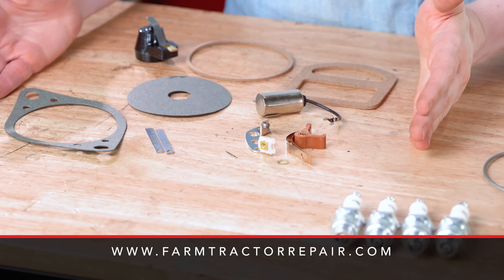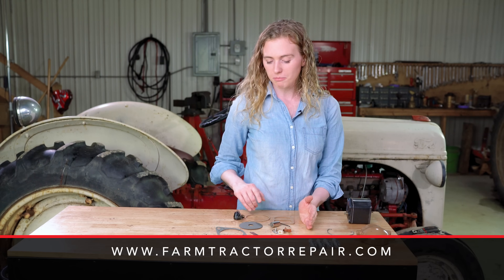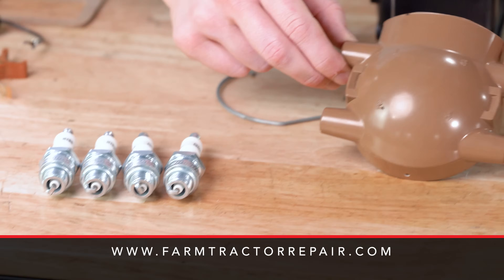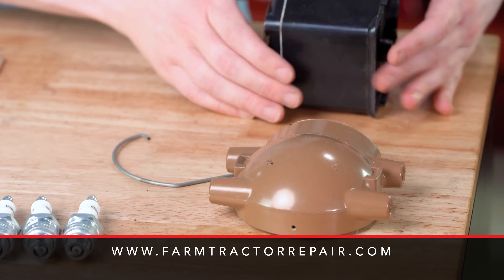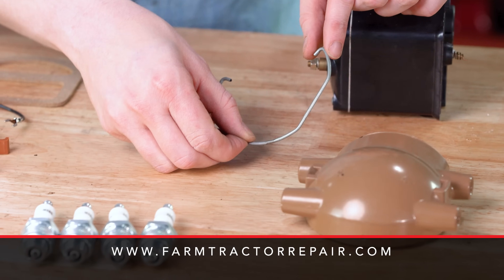To tune up the distributor on your own tractor, you will need some parts. This in front of me is what we call the tune-up kit, which comes with the points, condenser, rotor, and gaskets. We also offer many of these pieces independently if you only need a portion of the kit. New spark plugs are always a great idea. We offer a new cap which has the firing order on it, and a new coil in either 6-volt or 12-volt. This bail goes inside the distributor and is broken quite often, so if you need a new one, you can order it as well. All of these tune-up parts are available on my website, farmtractorrepair.com. You can purchase the parts on my site to help fund future tractor tutorials.